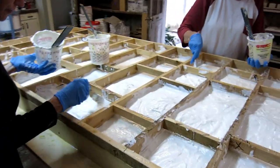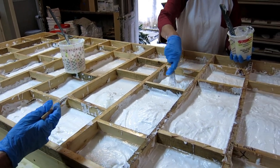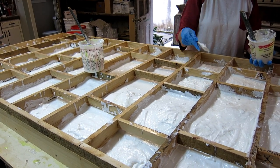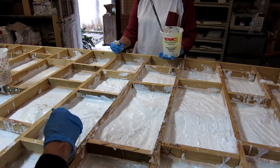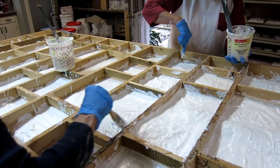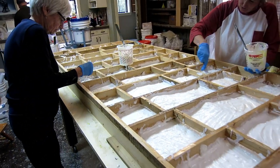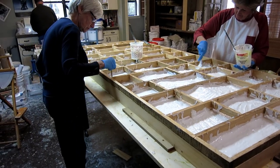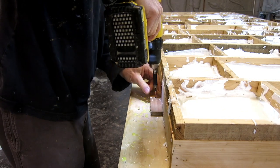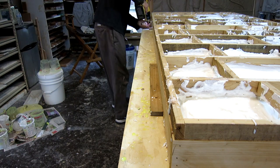We applied the plastic with lots of thickener in two layers. Unlike the rubber, we don't have to have 100% coverage — we just need support for the rubber, like 90% of the spots. We don't have to have 100% contact with the support framework, just enough so the thing doesn't change shape when we flip it over and pour the relief in the middle. We told ourselves we'd allow a full two days cure on the rubber and plastic to make sure we weren't going to distort something.